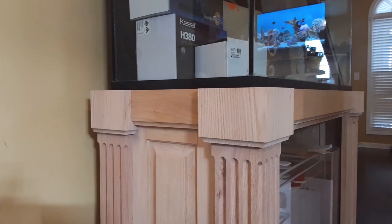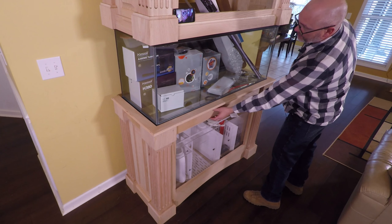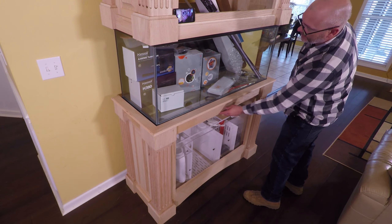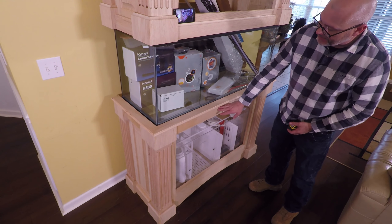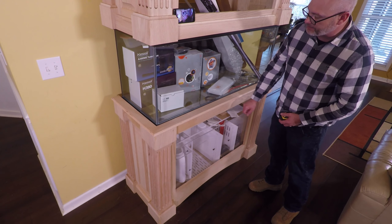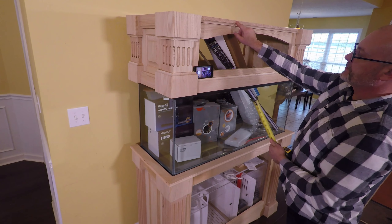And I'll continue that process all the way around. The only difference being the ones that face the wall don't wrap all the way around, but they stop flush with the back of the flute board. And now for the trim that connects one column to the next — this piece of trim is three and three quarter inches from top to bottom, and there's a cove detail at the bottom edge that you can see is repeated up here on the canopy. For the stand all the way around, these are three and three quarter of an inch. For the canopy, we're looking at three inches here and an inch and an eighth up here.